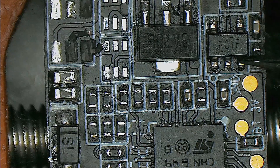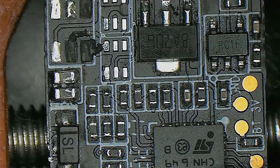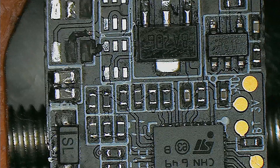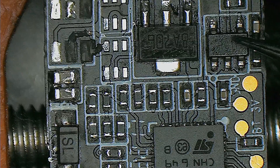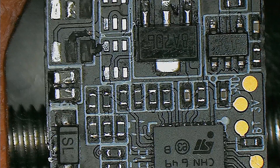The 3.3V regulator is getting pretty toasty. If I would have to guess, I would say that the MCU is dead for some reason related to the breakage here. But I'm not certain. Sometimes the MCUs do get broken halfway, and this could be one of those moments when the MCU gets half dead. Or we could have a bad IC that measures the current draw. I'm not yet certain, but I am most definitely sure that this one measures the current draw — we could try and take this out and see if the amperage goes lower. And if not, I will have to take this MCU from a donor and place it here and see what we've got.